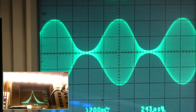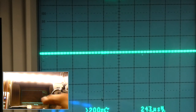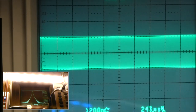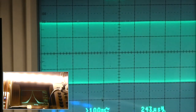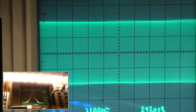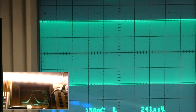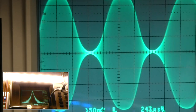And each one of those ticks of the reticle is relevant to the percent of modulation in the power of the two sidebands. Okay? You've seen that little bit. Oh, that doesn't matter. It does. Now let's go like this and say that we are only one bar. I know I'm repeating myself. We are only one bar up and down. But this would be simulating a scope that's out of calibration. See the difference?